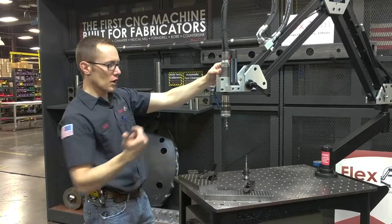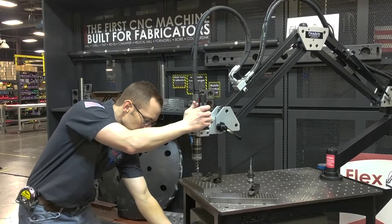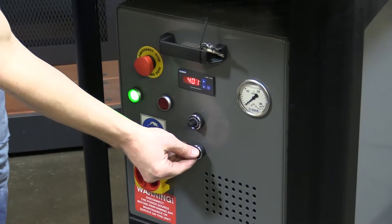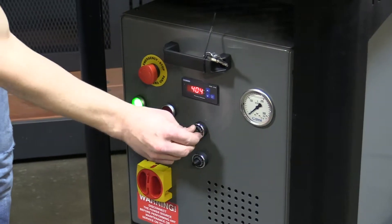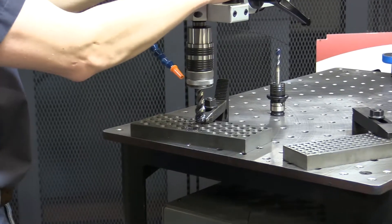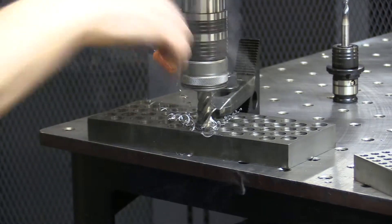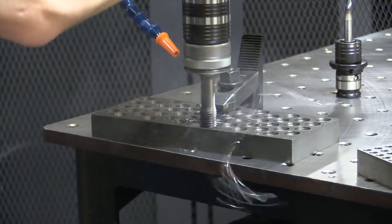So I'll show you — we'll dial in for a three quarter inch tap here and tap it. I'm going to slow down the RPM a little bit, put it down to around 400. We'll keep the reverse full bore. Line up over the hole, go straight down — clutch releases at the bottom so it won't break — then hit reverse.